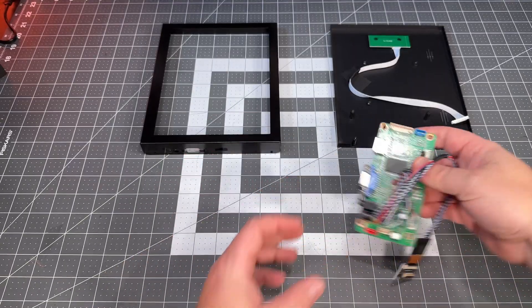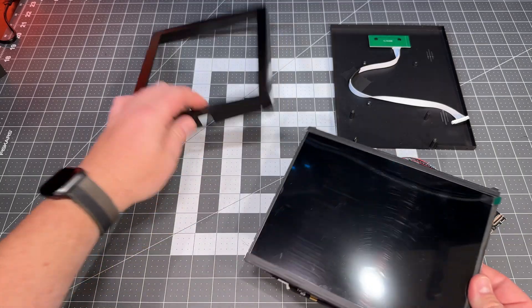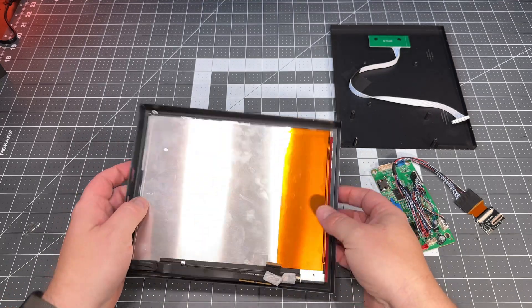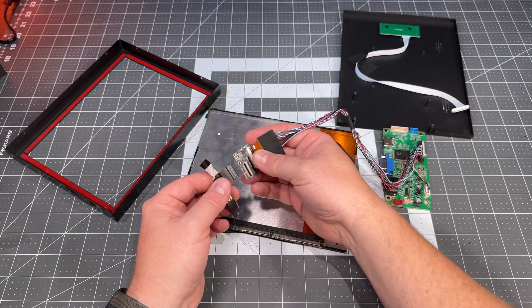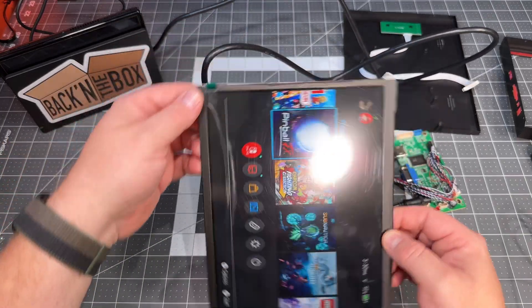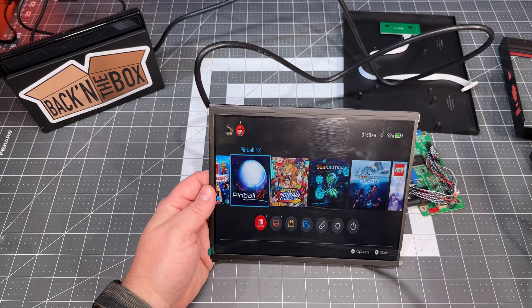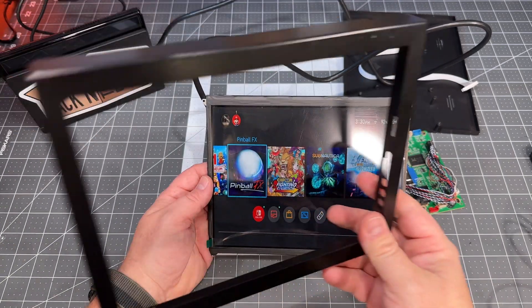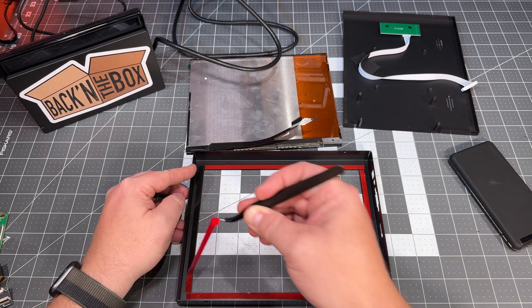Here's the encoder board for the iPad 2 screen. The iPad 2 screen fits onto this metal frame, which has 3M tape — we'll test the fit first to make sure it lines up and to see how the bezels are going to fit. Then connect the encoder driver board and test the screen, because you want to confirm you're seeing the signal before putting it all together. Leave the film covering on the screen until you're ready to attach it, to prevent scratches while working.